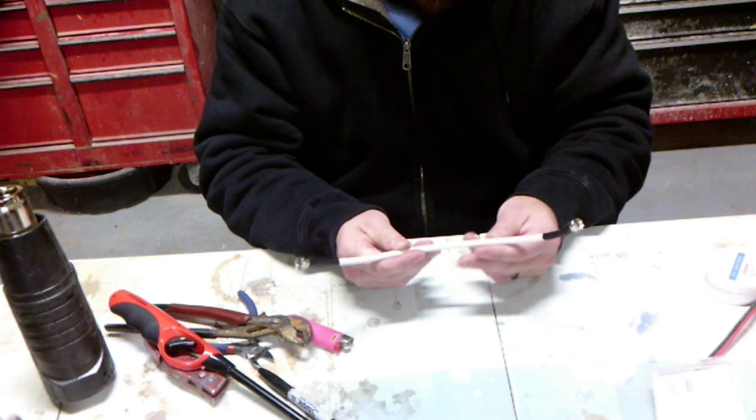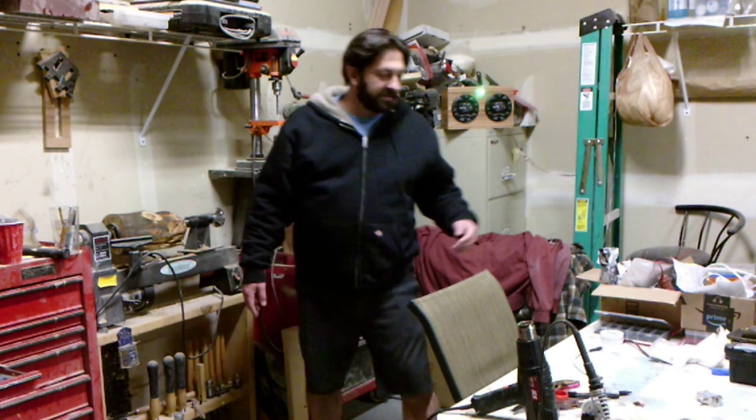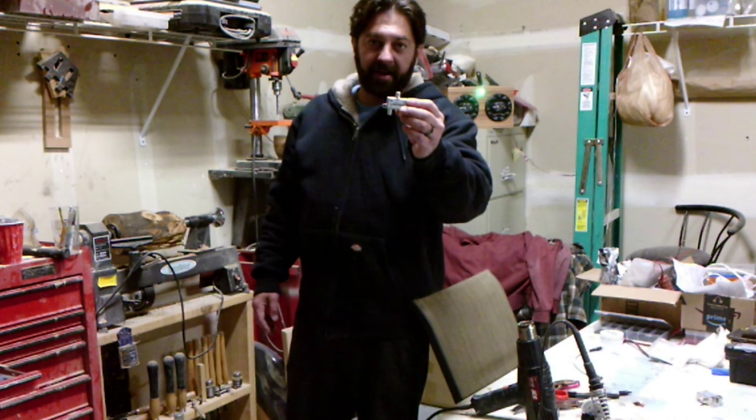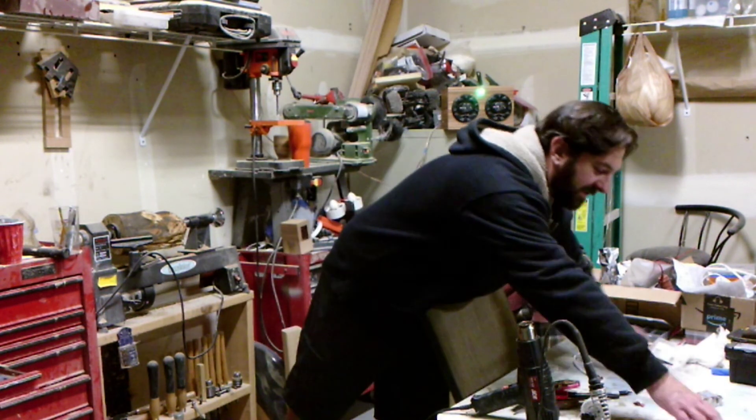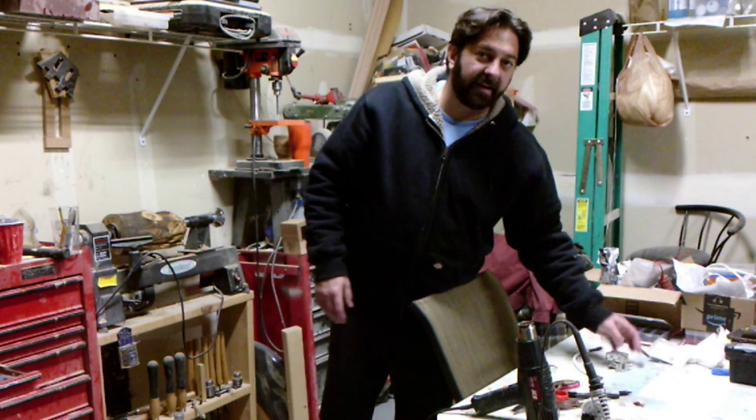Alright guys, kind of a bummer, but what are you going to do? Just a quick recap: we wanted to try to put two signals down the coax in the house — the TV antenna and the cable internet. We tried first a normal cable splitter — it didn't work, neither signal worked. Then we tried diplexers on both sides of the cable where we brought the signals together and broke them back out — that didn't work either. It's a miserable bummer, but I think what I'd do is punch a hole in the house and bring cable from the antenna directly in. It's a rental so I can't do it, but that's what I'd do if I were you. I guess I'll get ready for some more videos and see you guys next time. Bye.